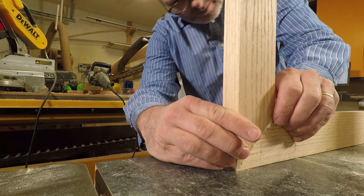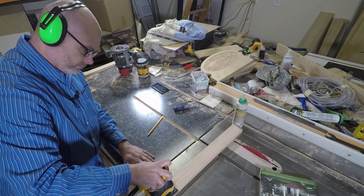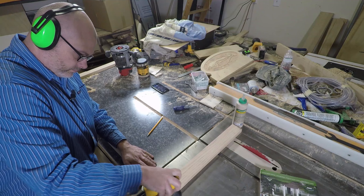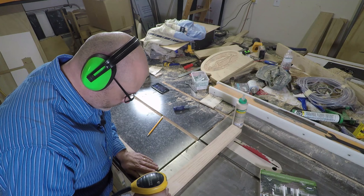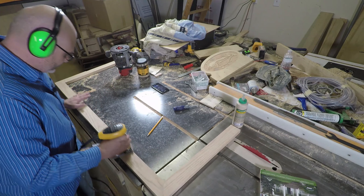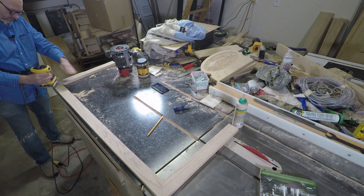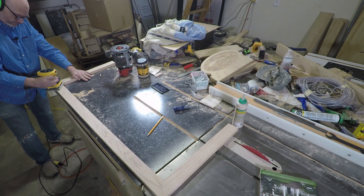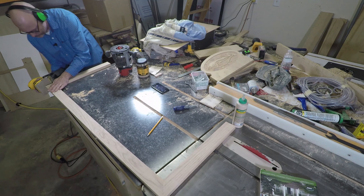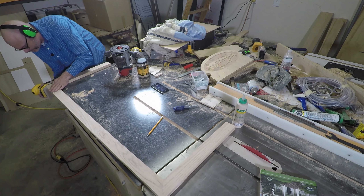Now that I have this piece of trim assembled, I'm ready to go ahead and cut the decorative detail in the edges. I want to go ahead and sand the joints smooth, and after the joints are sanded smooth, I want to slightly round over these corners here. That's really for no other reason than I just don't want a sharp corner that may cause damage when you would be walking by — because this is just at the right height that it may snag on somebody's clothes and cause a tear. So I definitely want a corner that's slightly rounded so that you'll just kind of slide off of it in the event that that happens.